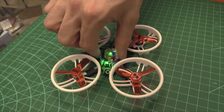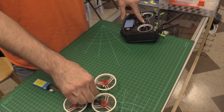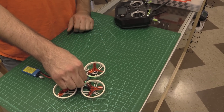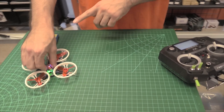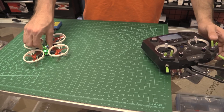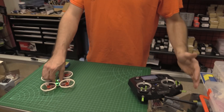This is the second failsafe. We're going to arm and put it in air mode so you can see. Now we're losing signal — radio's off, going into failsafe. Hear the motors slow down and then shut off — that's Betaflight's default land mode, lowering the RPM so it doesn't just fall out of the sky. Now I have the radio back but I don't have control. With the second failsafe, you have to disarm and arm again. Command reset is by disarming, letting it sit, and then resetting.